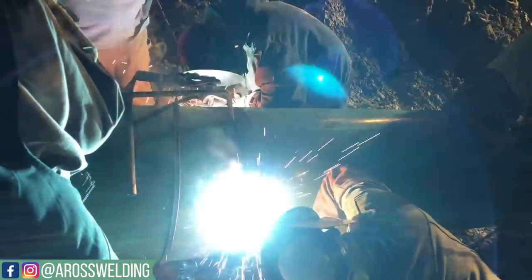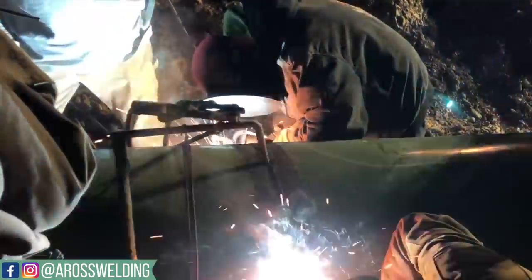Grasshopper is just a grinding device that keeps the arc inside the bevel without arcing any other parts of the pipe. Wagon tracks are what we call the little lines left after you start grinding the bead — there's two little lines. It's basically undercut, but they're little bitty black lines that look like a little old covered wagon went up the pipe, two tracks in the dirt. Sometimes welders want a little bit of wagon tracks, no wagon tracks, things like that.